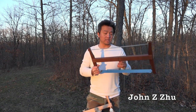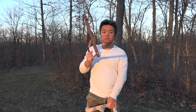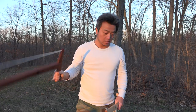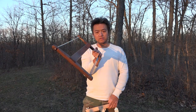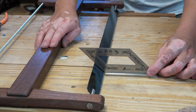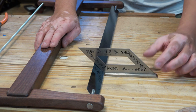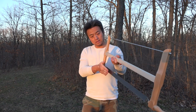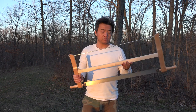There are two main differences between a Chinese frame saw and a European one. The first is the way it's held — the Chinese frame saw is held with a hand over the pin, whereas the European has a handle. The second difference is that the Chinese frame saw blade and the frame itself is almost always at a 45-degree angle, whereas the European version the blade and frame is almost always used along the same plane. But besides that, the two saws are actually very similar, nearly identical.